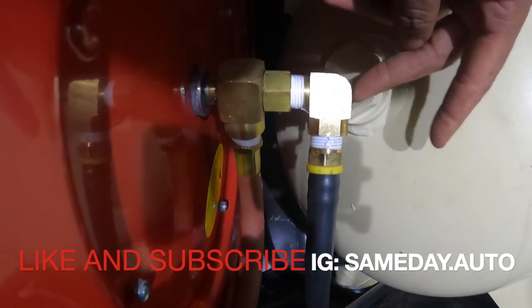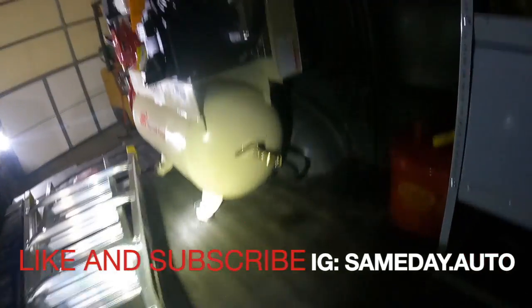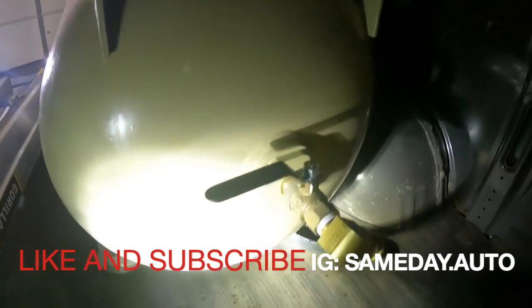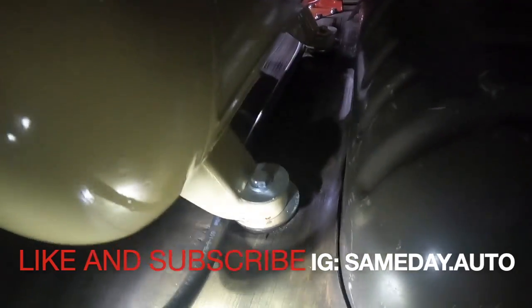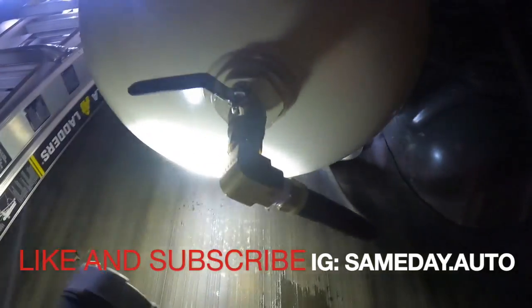Make sure you get these proper fittings — brass half-inch streets. On the tank side, as you can see, I hooked up the tank side. You can observe the same setup here: street elbow into a half inch, and I tucked it neatly under the tank so it's out of the way, won't get caught, won't get grabbed. That's how you hook the airline up to the tank.